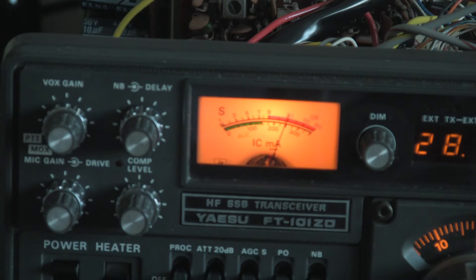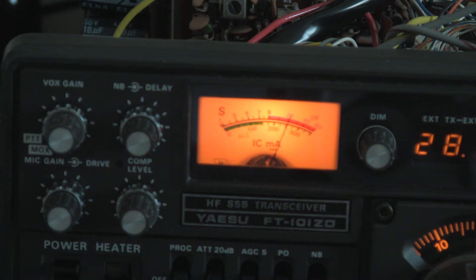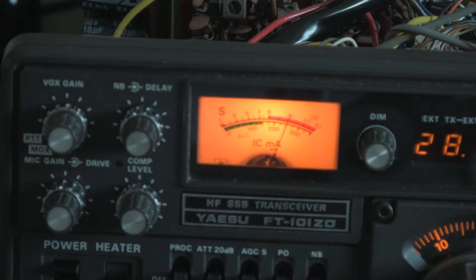I'll just do one last thing just for kicks because we haven't done this. We'll go to FM mode like that, we'll turn on the modulation — that's FM modulation — and we'll just turn the RF level down. And the squelch is kicking in. So you get a reasonable signal.